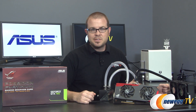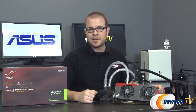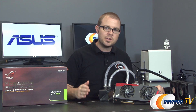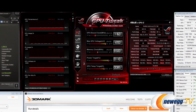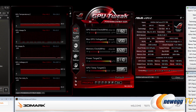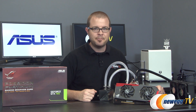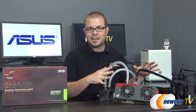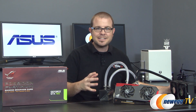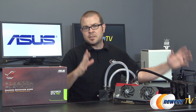With the water cooling loop set up, GPU temperatures actually dropped by about 20 to 25 degrees Celsius depending on the benchmark. That allowed me to achieve a very substantial overclock using the Asus GPU Tweak software. I bumped the GPU's boost clock up to 1241 MHz max, up from the out-of-the-box boost speed of 1058 MHz — about a 17% bump from the manufacturer's overclock and more than 23% faster than the reference GTX 780. I also pushed the memory speed from 6000 to 6500 MHz, and the highest temperature seen during testing was 49 degrees Celsius, so it never even got above 50.